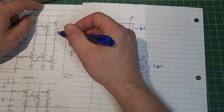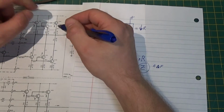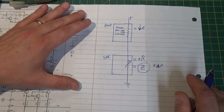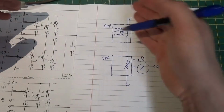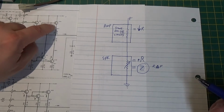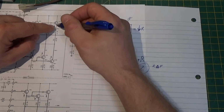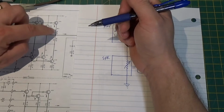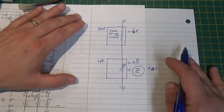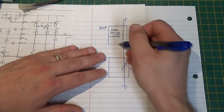And these current limiting resistors are here, just that if something overloads here, this guy takes the hit instead of this guy and protects your transistors from peaks, okay? Because this is such a low impedance circuit, you have to have something in there, or if a transient or a spike of sound comes through there, it could actually exceed the limit of the semiconductor and damage it. In this case, though, that would be carried off into the resistor as heat. So that's why it's called current limiting. But anyhow, it has a relatively low resistance. And so as a result, this is considered a low resistance.